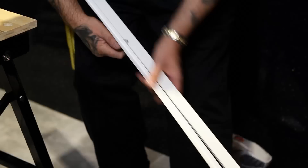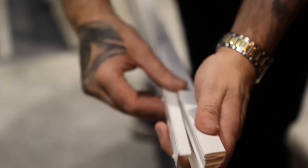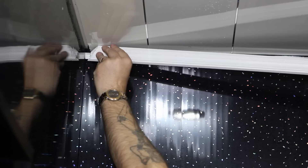The penultimate job is fitting the cornice. Remove the excess back trim from the cornice and discard. Measure the space as tightly as you can to ensure a snug fit. Cut the cornice to size and miter the edges. Then separate the piece into its two components, putting the solid part to one side for the moment. Hold the backing plate as high as you can to the ceiling and screw this tightly to the surface through the lip. Your solid cornice will then clip nicely onto this fixed backing plate. Repeat this process on all walls.